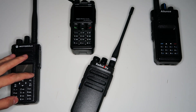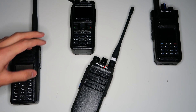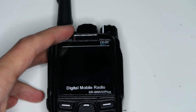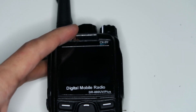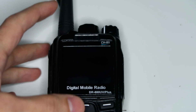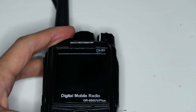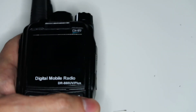In case anyone was interested, that Motorola setting doesn't work with the single frequency repeater on this radio. I had to program up some channels using dual capacity direct mode on the Motorola to get it to work with this. If you've got this radio and want to try it out, let me show you how to set up the single frequency repeater. You can do this either from VFO mode or you can program it into channels — it doesn't really matter either way. I'm going to be doing it with channels just because it's easier since I already have them set up.